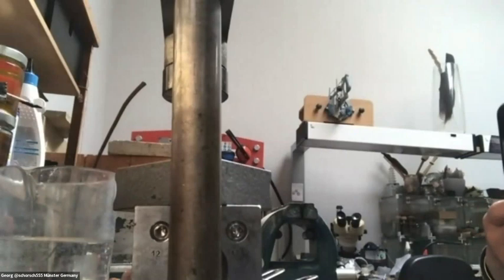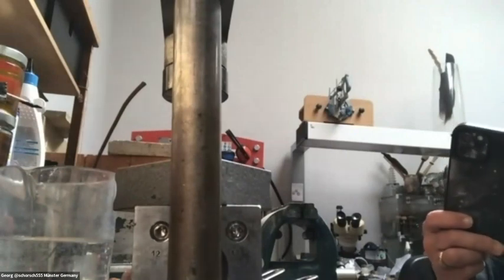That's what I usually do with my files. When I burn in files, usually they don't need any extra hot glue or epoxy or whatever. With the carving knife, I would be a little bit more precious with it, but you're probably right that you can burn in the tang and you let it cool down, and you tap it, hammer it in with the hammer in the last bit, and probably that will secure the blade as much as needed. So, yeah. And it's the absolute classic technique for fitting chisels to chisel handles as well.